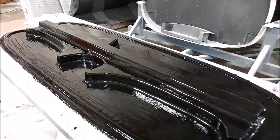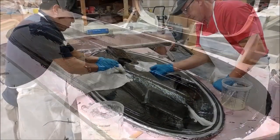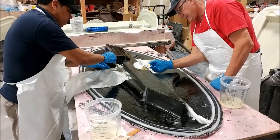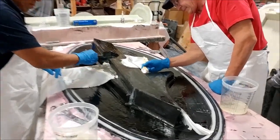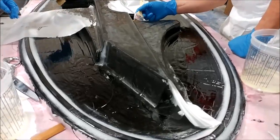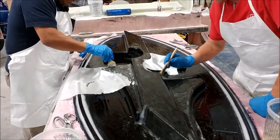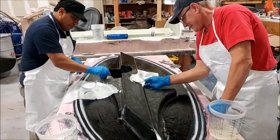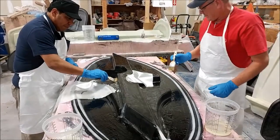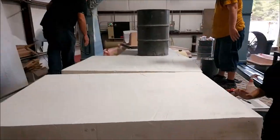This is the plug for the rear seat mount — it's had its black top coat applied in preparation for having the rest of the mold laid up, with a layer of light and a layer of heavy. Here's Roberto and Chris working on the front seat mount mold. This one is just going to use glass and not carbon fiber, since it's not a full structural component.